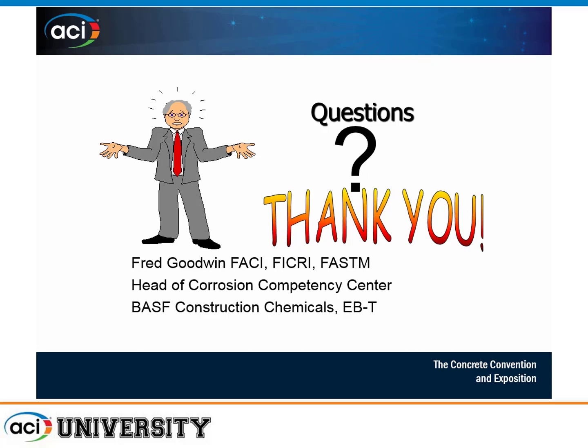Question: Is phenolphthalein a contaminant you have to remove after doing the carbonation test? Answer: No, you really wouldn't have to remove it. It's just that if you have embedded steel, carbonation will allow general corrosion to occur. There are two kinds of carbonation: early-age carbonation from high CO2 levels when the material is fresh, which causes efflorescence, dusting, and laitance on the surface; and longer-term carbonation where CO2 slowly penetrates the concrete — it doesn't harm the concrete itself but causes corrosion of the steel, which can then blow things apart. Phenolphthalein, to my knowledge, doesn't cause any bonding issues — it's typically in an alcohol solution and dries very quickly.